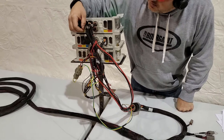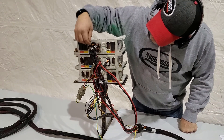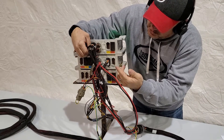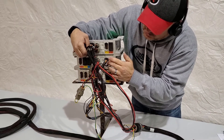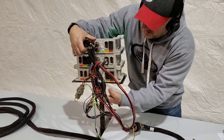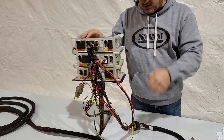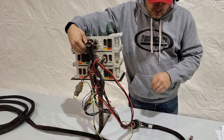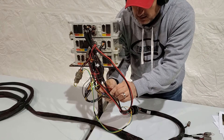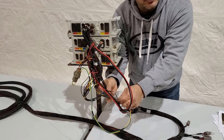In the ECU breakout there's going to be a small blue wire in each comms connector. At pin 17 — it's hard to see in the video, but if you look at pin 17 it's blue. All three connectors are going to have that, because all three can individually be put into the safety loop. If that wire were to be removed — which probably isn't recommended — they come back and splice off into one single wire.